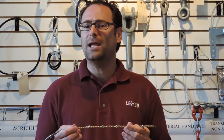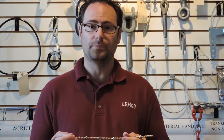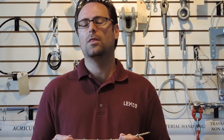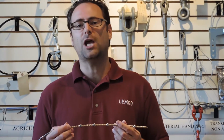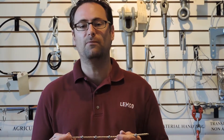If you need full break strength out of a ball fitting, one option, if you have high volume, you could consider a die-cast fitting. If it has the right dimensions, a die-cast fitting could potentially hold to the full break. But the majority of solutions for when a ball needs to hold to full break, the way to go is with a shank ball. And shank ball is another product line that we have under wire rope fittings, and that is the next video in our series on wire rope fittings.